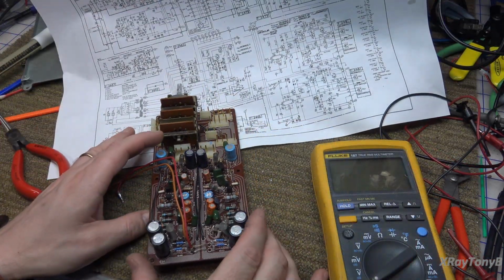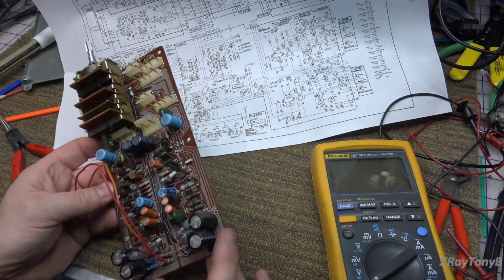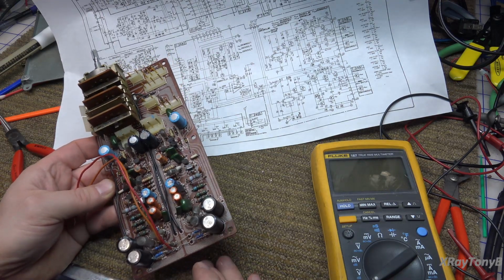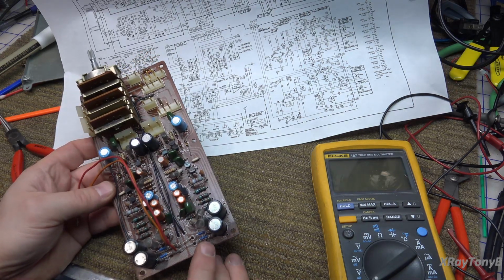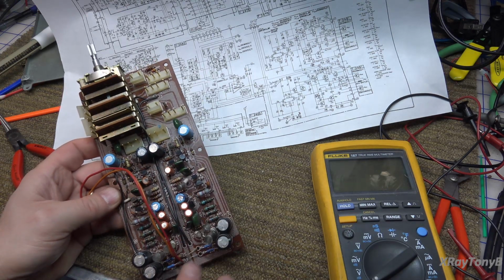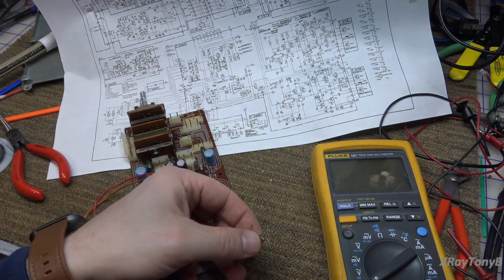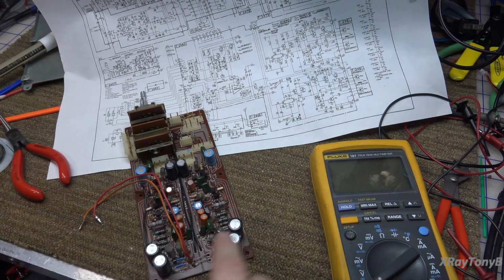Okay, old resistors out, new resistors in, and I think we should be good. These aren't true fusible resistors, but they're metal oxide, and they should work okay. You may be inclined to put larger ones in there, but that's not really what you want to do. The idea is these are a good example. They did their job. They protected the rest of the circuit. When something went wrong, these popped open and prevented the rest of this from melting down. So maybe it's going to work now.